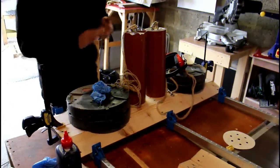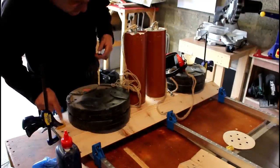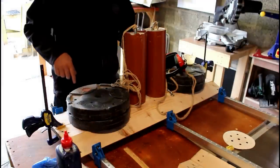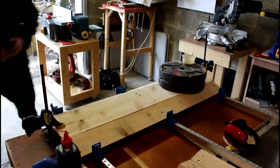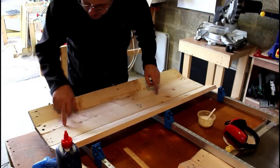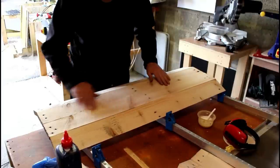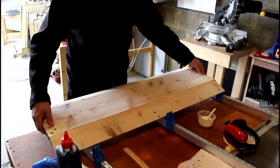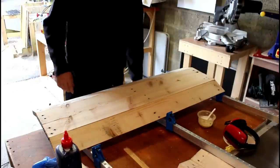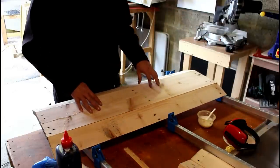It's been 24 hours since we last did this. We'll take off the weights and see if the glue-up has helped. Yeah, that's nice and solid — those joints are quite tight. There's a bit of damage here and there, but mostly that's a really nice tight joint. What we'll do tonight is put on one of the other sides and clamp that and leave it again. Then tomorrow night we'll clamp up the next one. This is a long glue-up, I tell you.